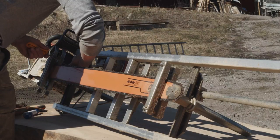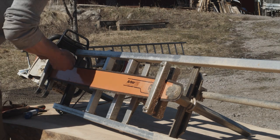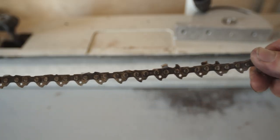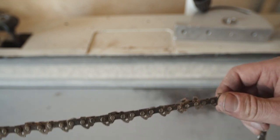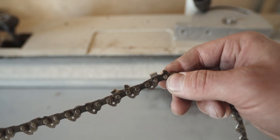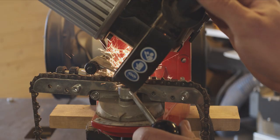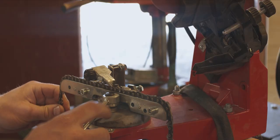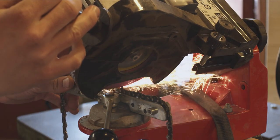People like to attach objects to their trees, but that's okay — we can deal with that. Most of the time it's only a few nails here or there, and nails are fairly soft. But if you hit a screw, then you're screwed — well, sometimes. Screws are a lot tougher than nails. Oftentimes people make the argument that a chainsaw chain can handle cutting through metal better than bandsaws, and maybe that's true, but I still find that I ruin a lot of saw chains anyway when cutting through metal, so I don't think that is a very relevant point.